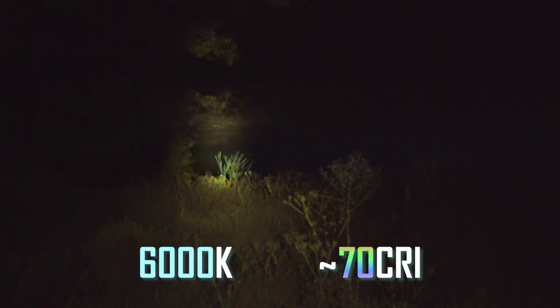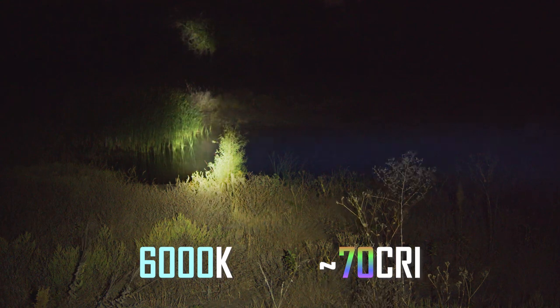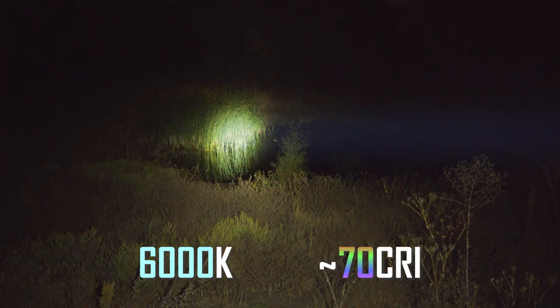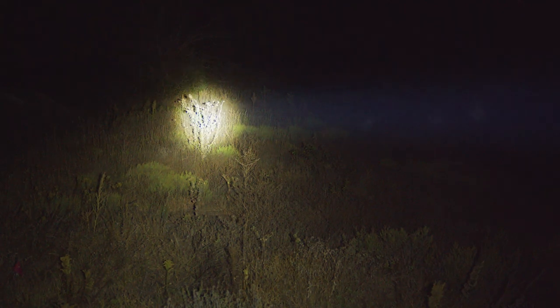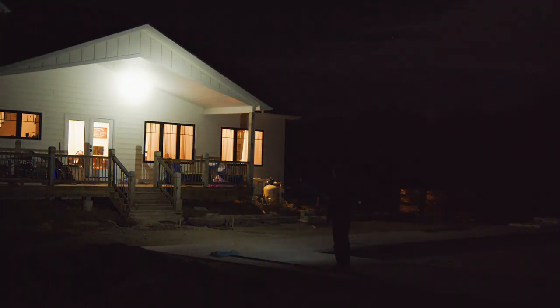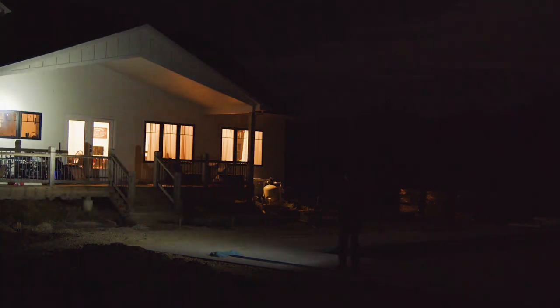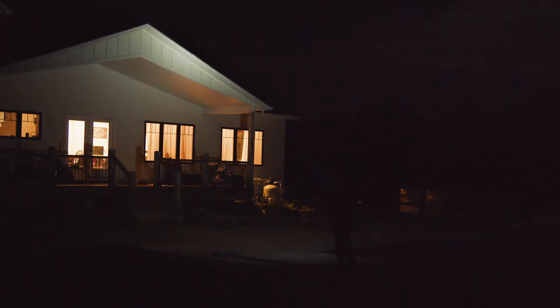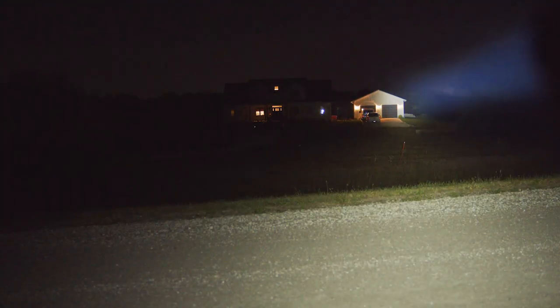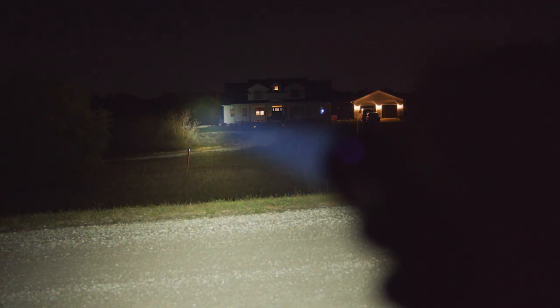Coloration coming from this Osram emitter is not great. The beam is very cool white at about 6000K and has a low CRI of less than 70. The center of the hotspot is white, while the edges are greenish yellow. The spill has a strong magenta hue, though it's not very noticeable as it's so much dimmer than the spot. While it's poor, the color here really isn't an issue in my opinion. When it comes to throwers, I think performance matters more than coloration anyways. If I'm trying to see something at a distance, I'm not overly concerned with how nicely its colors are rendered. This is unavoidable, as Osram only makes the white version of this emitter in a low CRI, cool temperature variant. Basically, it's intended to do one job, and it does that well, so there's not really anything to complain about.